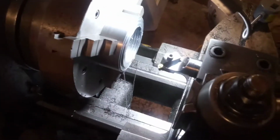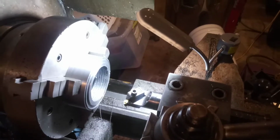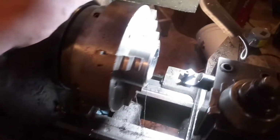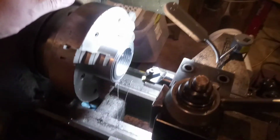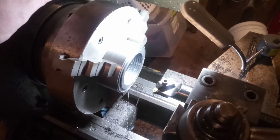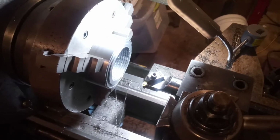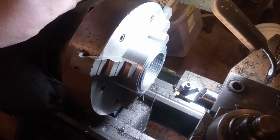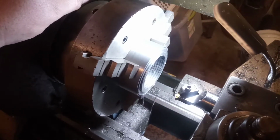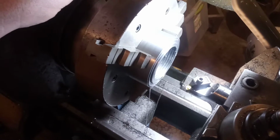I talked to one of the head engineers at my job, absolutely brilliant guy. I always go to him for all my stupid questions, and he humors me and usually answers them. What he suggested was try to bump up the voltage if I could. It's a 110 motor. Now, I don't care if it destroys the motor, because obviously I'm getting ticked off at this motor, and if I gotta find a 2 horsepower or a 3 horsepower motor, I will. But if I don't, and I bump up the voltage to, say, 130 or 140 volts AC, and it gives me the extra oomph I need to get the job done, then it's a win-win.